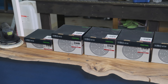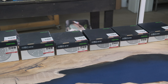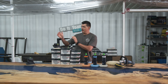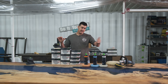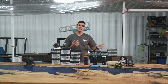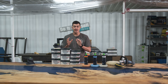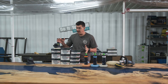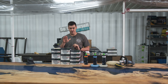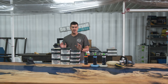With your finishing sander, you go from 120 grit all the way to 1500 grit — you cannot skip one sandpaper grit, or you will not get the perfect finish. For each grit, we put on a new pad, sand the table to one side, put on a new pad, sand the other side, and repeat — three times per grit. It's like fishing: you need a lot of patience when it comes to sanding. This is the main key to getting the perfect finish — not the polishing. The sanding methods are the main key.